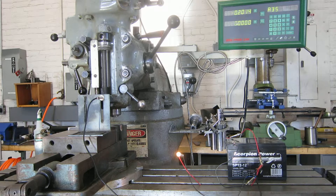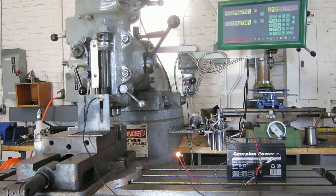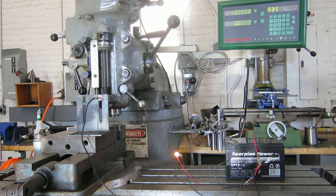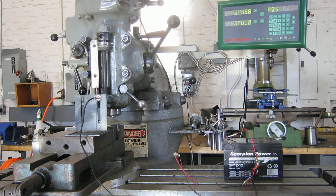I've moved the sensor off about a quarter of an inch from the edge. Watch when the light goes out. It's still on. Okay, so we're five sheets of paper away from that edge. Coming closer. Two sheets of paper away. We're within a third of a sheet of paper. Now that's two tenths away from where I zeroed it. Let's keep going and come in the other way.